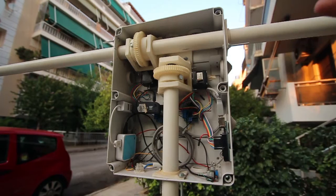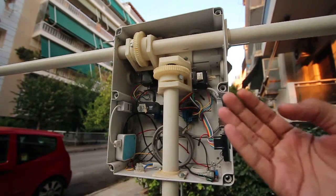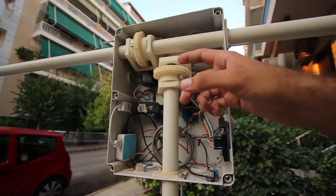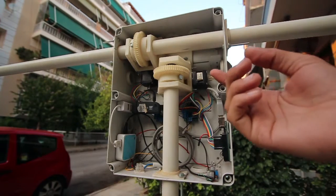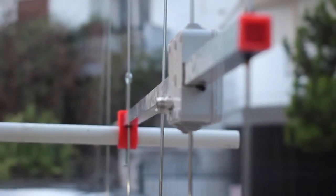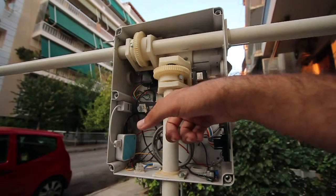That's the tracking part. The other major subsystem is the one regarding receiving the signal. Once we have a satellite tracked and all commands issued from TP-Link to Arduino to stepper drivers to stepper motors, we basically point two antennas — which are supposed to be on this side and that side of the main mast — and once pointed at the satellite, we're receiving in both VHF and UHF through two different antennas, coming into some DVB dongles here.